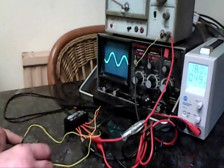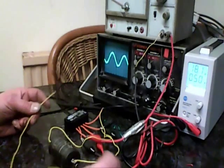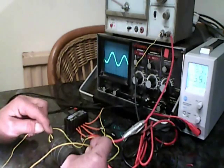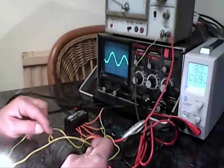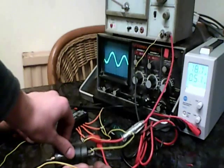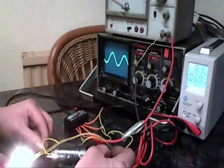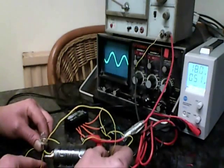Right, here's the magic one: a 4-inch wire nail through the hollow core of our transformer. We have a 4.7 volt bulb, 0.75 of an amp, and this should light straight off the ends. As you can see, quite bright — pulling about 0.69 of an amp there, it's nearly up to its full rating. Watch this — pulling slightly more current, but this is off the ends of the wire nail.